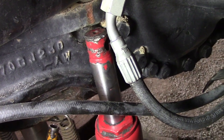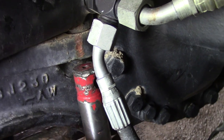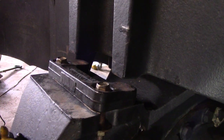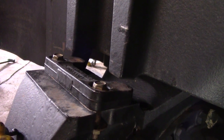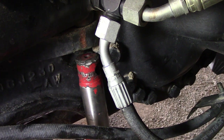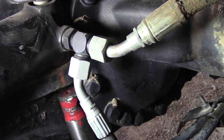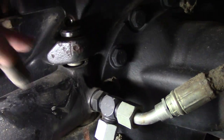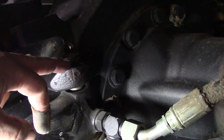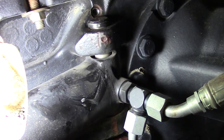This is what I meant by using the long jack to put pressure on that pin. If you wedge wood in there so the axle won't pivot, you can actually get it wedged in well enough to lift both tires of the tractor off the ground. But this side is just as stuck.